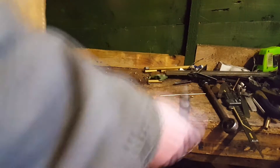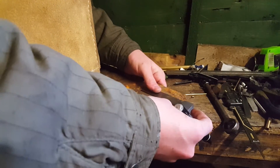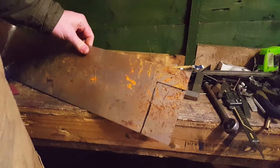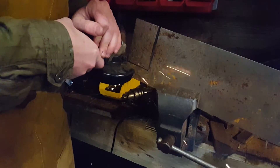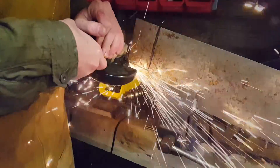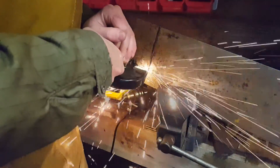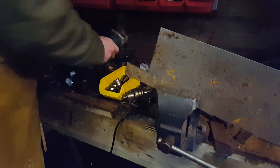As you can see, I'm just marking out to cut the sides of the boiler using 1.6mm bright mild steel — I think I just found it in the bin at work, it was going to go to the scrap man anyway so I thought I'd have it. I've got the trusty old angle grinder out; it's a key part of any workshop. It's not exactly the finest of tools but it hogs out material pretty well and for cutting this sheet it's more than adequate.